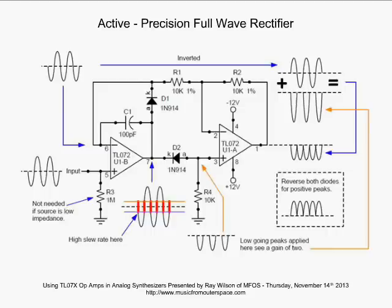It's just really cool. All right, the thing about rectifiers is that when you use just diodes, they require about 600 millivolts before they even begin to conduct. You need to forward bias the diode in order to get it to conduct. So if you want to rectify a small amplitude signal, that's going to pretty much get in the way, because you can't even get the diode to conduct until 600 millivolts. Well, what can we do to fix that? Well, let's see how this works.